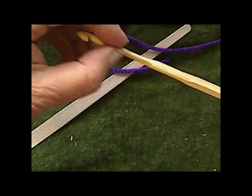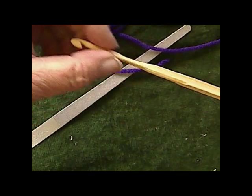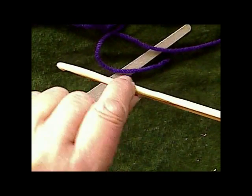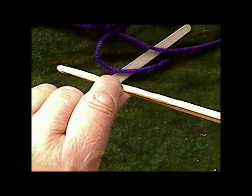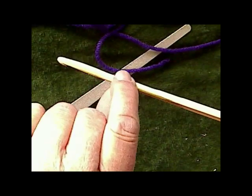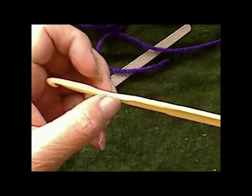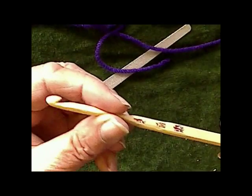If you find a small crack or something, there's a trick you can use instead of just saying, okay, all that work for nothing, go get another one and start over. Take a little bit of super glue, and the liquid is best, the gel not so good, and let it seep down into the crack. Let's say you have a crack right across here. Let it seep down into the crack, and then set it aside and let it dry all the way, and then come back and sand it. And it'll totally fill in your crack, strengthen your piece, and allow you to continue on.